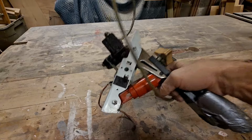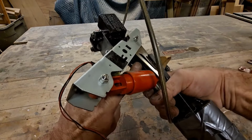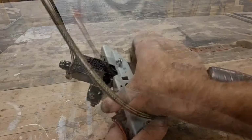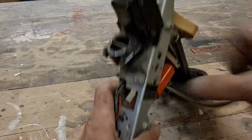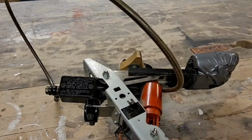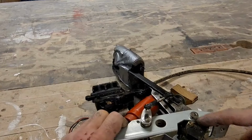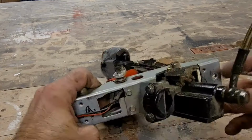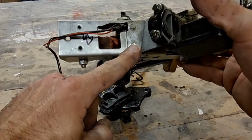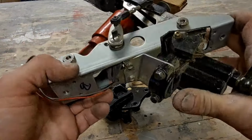Well, if you could see inside, down into here, where my finger is, this is actually a hand grip. Imagine, here's the round bar. This is where it would grip onto, and this is set up for a pit bike. Now, what I did was clearance the top section of the pedal, and I was able to get this thing mounted in with a plate that sandwiched this together, which holds it in place.